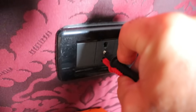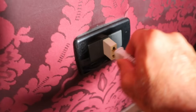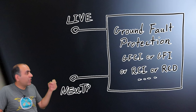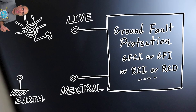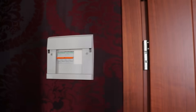The bottom one seems to be the live wire, the top one is neutral, and the center is ground. This is what I brought for my adapter, and I came prepared with an extension cord so I can plug in multiple things at the same time. I don't see any GFCI or ground fault protection around here. Ground fault protection triggers if current, instead of flowing from live to neutral, flows anywhere else — say to ground through your body — and disconnects electricity and saves your life.